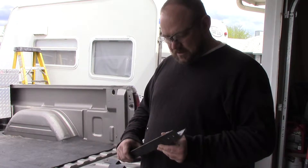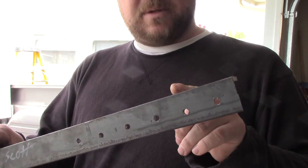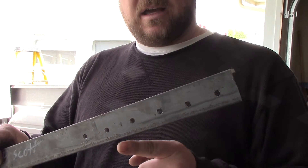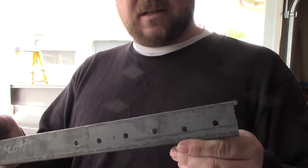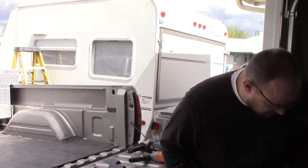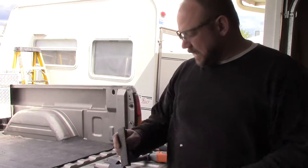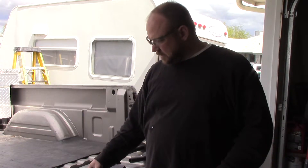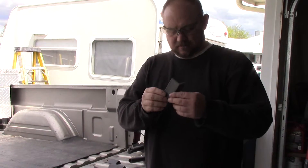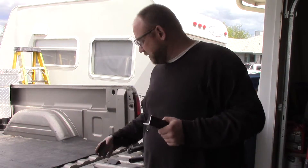So I'm going to overbuild this with some really thick gauge angle iron. I'm just kind of drilling the holes, and these are going to be inch-and-a-half pieces, so each hole is going to come off and be a half-inch piece with a hole in either side of the angle iron. And this is what's going to connect these little L-brackets basically to the solar panels. And then I've cut six of these five-inch pieces that are going to be the risers that are going to bring it up off of the deck up there. And then I've cut six of these shorter pieces — I didn't really measure these, I just made them all the same length because I had some that were already pretty good.